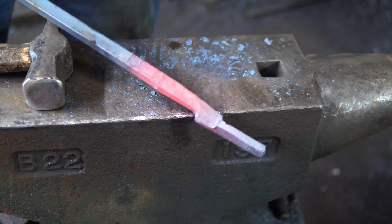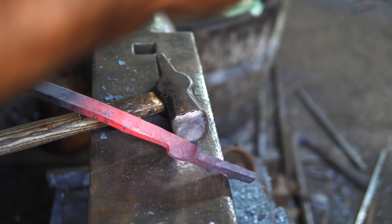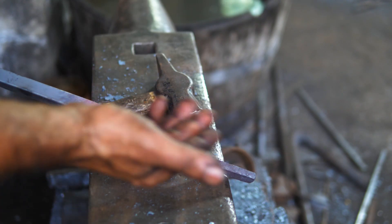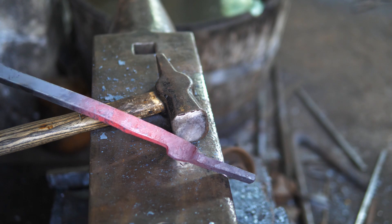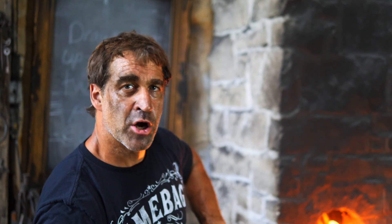Now I'm going to draw out the reins. I could do that by hand but I'm sweating like crazy already and I've got a power hammer right there, so I'm just gonna draw it out. If you're a beginner you're going to have to draw those out by hand. We did a how-to video on making tongs about six months ago but our production quality has improved exponentially since then, so we're redoing it to give you a clearer picture of what's going on. Please comment below and let us know if this is making sense to you. So I'm going to draw out the reins on the power hammer.